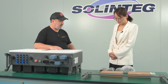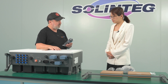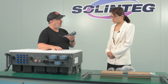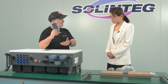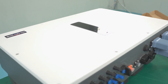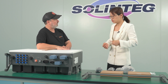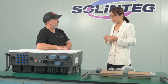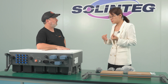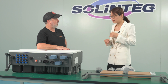We've laid out all the components from the box — these are the AC connectors for the three-phase inverter, and they're all plug-and-play connectors that just clip on. Everything is pre-wired to these connectors and then plugged in, making it very easy to install. Some other inverters require you to open the roof cover to make the connection, and if the installer is not so professional and doesn't tighten the screws properly when replacing the cover, this can compromise the IP rating.